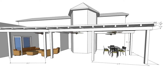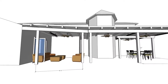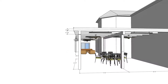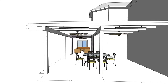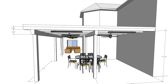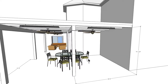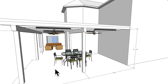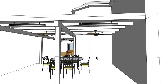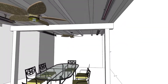The first option would be to place a couple of Infratech Slimline models — the SL4024, 4,000 watt, 240 volts each. With the table in the center here, there's no way to get enough heat from one side versus the other with the beam sitting here. The client also had some table components over here, so they'd probably use this whole area at certain times of the year, and at other times they might just pull the table to the left side. There's also a door over here — I didn't know how it physically swings, so this heater here might have to be eliminated if it swings out.